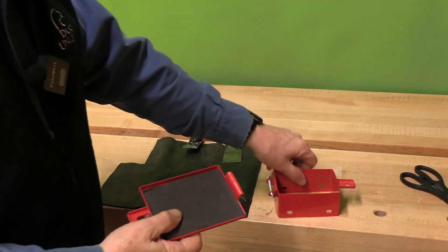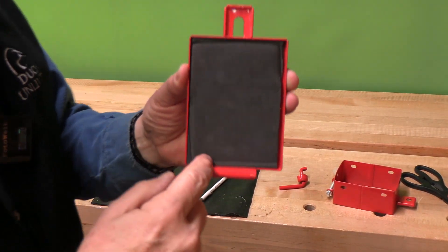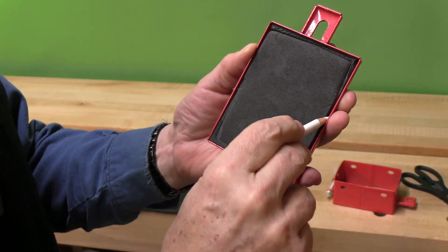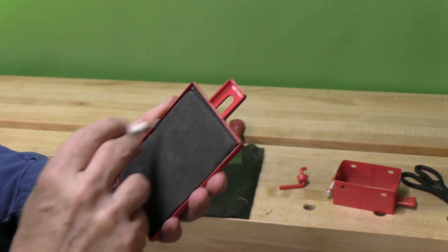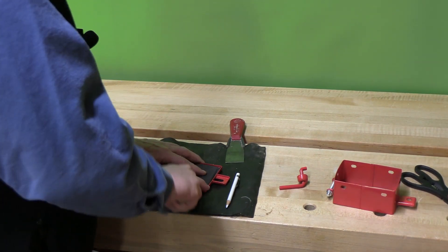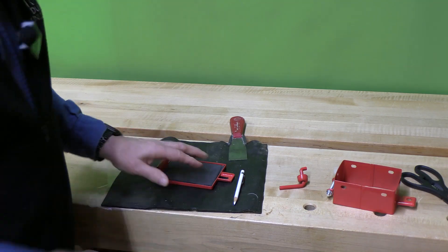So we have the metering valve set up here. Very large diameter, excellent high flow — that's why this works so well. A super easy way to change media. We'll drill the hole in the base of the dump door, which allows the media to flow in, be swirled around and made turbulent with the addition of air. Particulate is moving out of here so it has a very fast and excellent flow rate. When this is finished, this door will basically close. But the problem is that this has been imprecisely cut, and the steel right here is not in contact with the rubber, so there's going to be a leak. I tried to bend this but it doesn't work, so we need to remove this foam rubber and put some new material there.